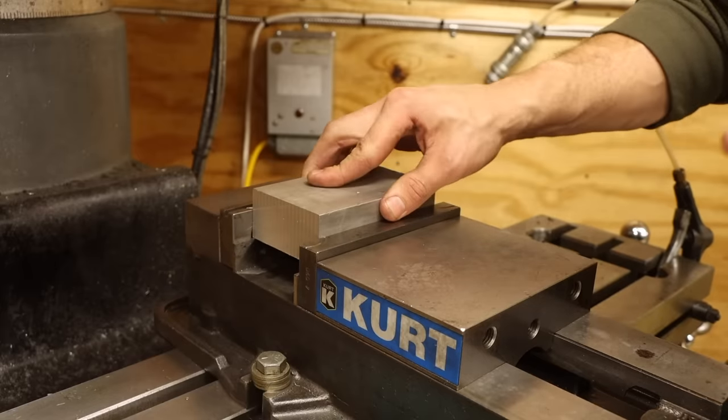The spring mounting hardware is pretty simple — a major diameter matching the pivot bushings, with one end turned down to accept threads and a smaller diameter where a spring locating groove will go. I'll use a die to quickly cut the threads, then part off and repeat the same features on the other end. After making two of this size and two more of a shorter length, I'll apply cold blue — this puts a black oxide coating on the surfaces which, combined with a penetrative sealant, will deter rust and match the rest of the black oxide hardware. I also treated the handle while I was at it, and the combination of knurling and cold bluing looks extremely sharp.